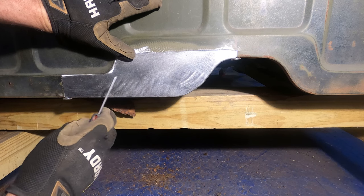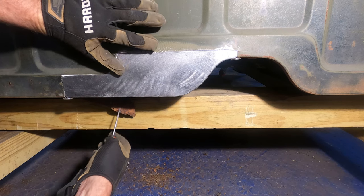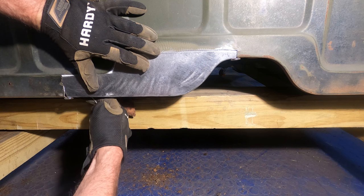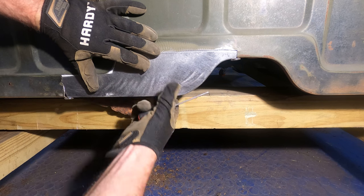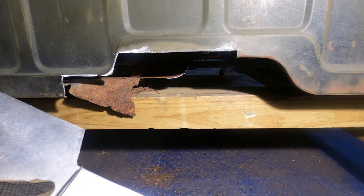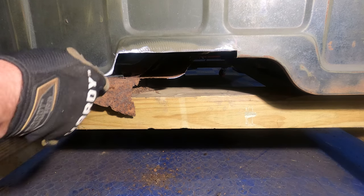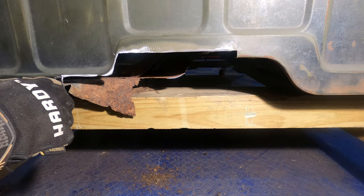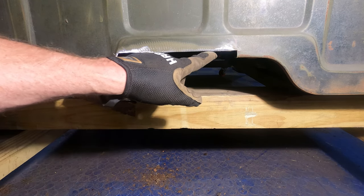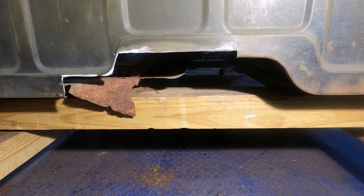And this one, I'm gonna take this piece down instead of taking more off the body. Just simply because I'm really close to that body seam. There we go. So yeah, that body seam is right near this scribe mark. Don't know if you can see that or not, but I want to take that down and more match this piece so I'm not so close to that seam right there. And then on the front, we've got just a hair, maybe almost a 16th of an inch there, but probably closer to a 32nd.